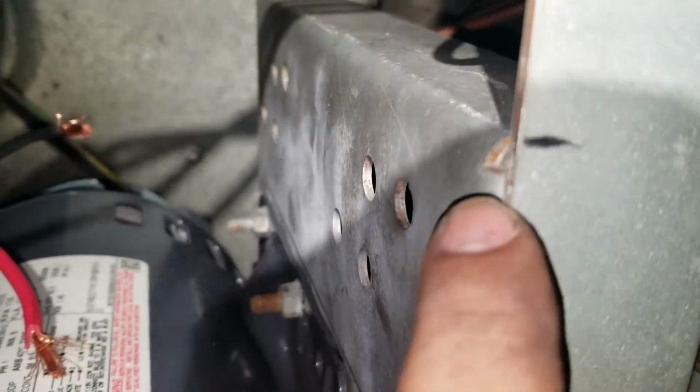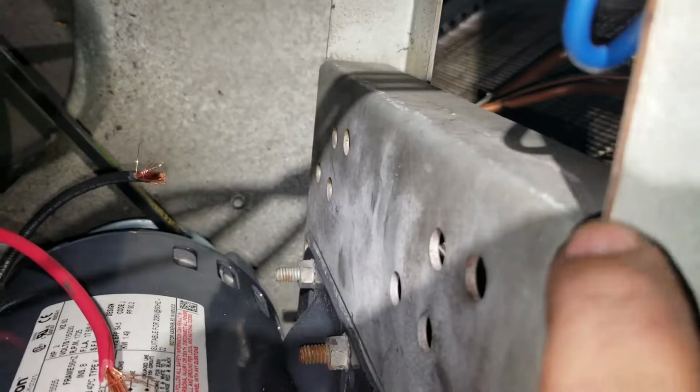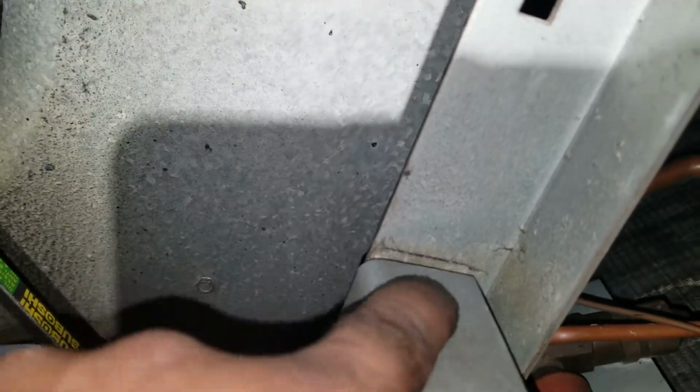You see, the belt is in. I forgot to show you these marks at the beginning before I took off the mount. See, I got that mark there. I matched up, and I scribed another one in the back. Back there, see the pencil mark? So we're really close, and the belt is good. I got good tension, so we should be good.